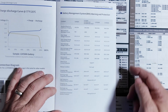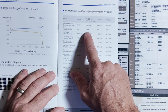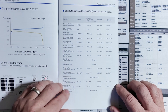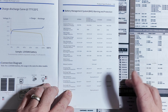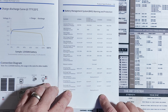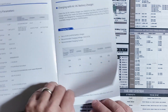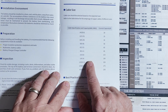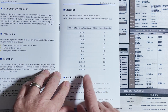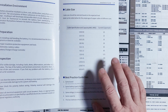The manual also gives details on the BMS included with the battery. The max continuous discharge is 100 amps. It offers all the standard protections: over-charge, over-discharge, over-current, short circuit protection, and both high temp and low temp protection — which is critical for me. The low temp charge protection is something we will be testing here in just a minute. I also like that it specifies cable sizes you should use depending on how much current you'll be consuming.